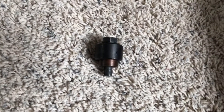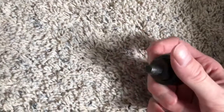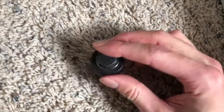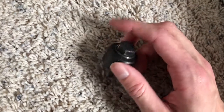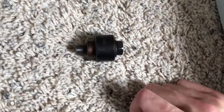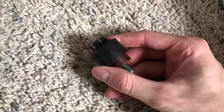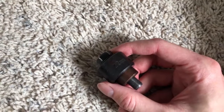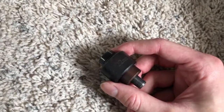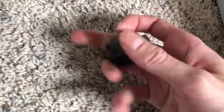Next, what you need are the correct tools to actually drill the holes. This is a little punch hole maker, and it's 22 millimetres — you can see on the side there. I ordered this one from AliExpress. It's pretty cheap, about £6. It's just got a basic washer there, and the more expensive ones have a bearing, so it's a bit easier to use. But this is absolutely good enough — you don't need anything fancier. You want to get one that's 22 millimetres. 22 millimetres is the button size I use. It's not super realistic, but it's ideal for people who just want a panel to use at home, because although the 30 millimetre ones are more realistic, they take up way more room and they're just not very practical for using on a desk. So I always use 22 millimetres.